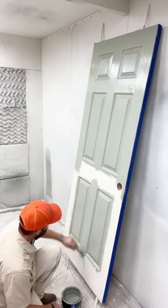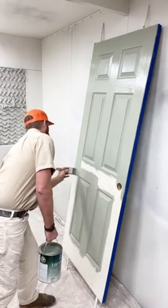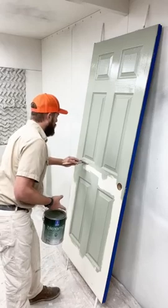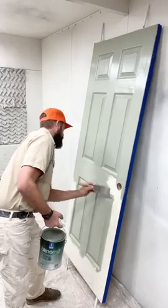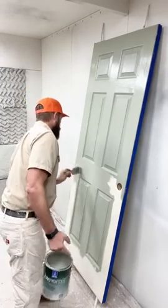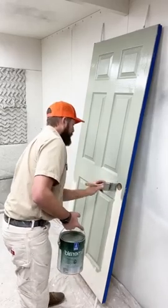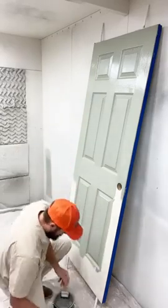Goes on very smooth. Some enamels are super finicky, and those who have been around the industry long enough have experience with some of those old enamels where they didn't cover very well. They're very sticky, and you almost have to, like, every brush stroke counts. With a lot of the new enamels, and especially Emerald Trim Urethane, you can put it on like house paint. As long as your brush strokes even off like that at the end, it gets great coverage, and it stays wet just long enough to level off, but it doesn't stay wet forever overnight like those old oil enamels.